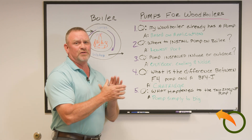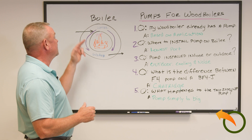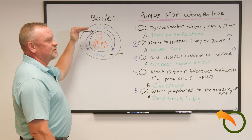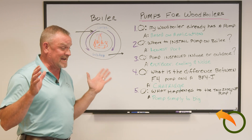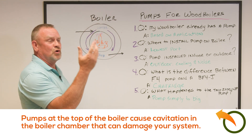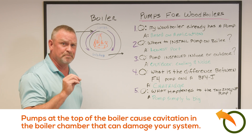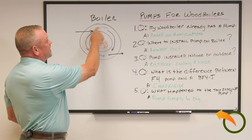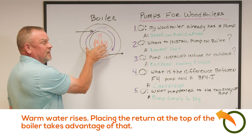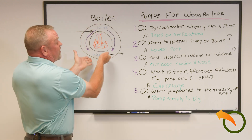Question number two: where do you install the pumps? All manufacturers suggest putting the pump on the highest port on the back of the boiler — they're wrong. The problem is that pumps will cavitate when pulling water from the top of the water chamber, just like a drain in a bathtub creating a tornado effect, sucking air and cavitating the pump. The other reason to put the pump on the bottom port is that with cold water returning from the house entering the top of the boiler, you'll be drawing water from the bottom, pulling it around the heating area of the boiler for maximum heat exchange.